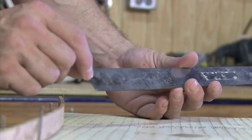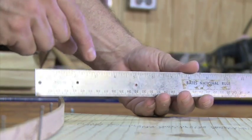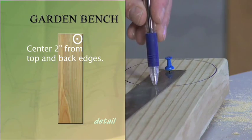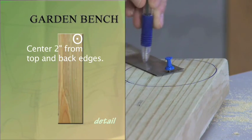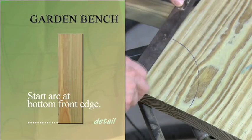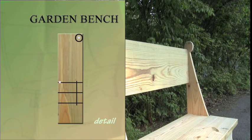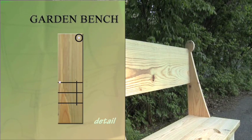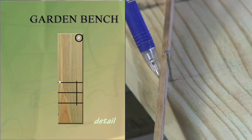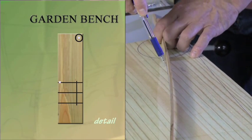Here's another simple trick — an old ruler. It had one hole already drilled in it so you could hang it up. What I did was drill two more holes, one at two inches and one at five. That allows us to create a nice arc pattern any time we put a pin in one hole and a marker in the other. At the bottom front edge of our piece, we need to draw an arc — for that, we'll use the hole at the five-inch mark on the ruler. The last curve we need is along the front edge. We need one more finish nail on the top line closest to the front. Place the bender board against the nail, hold it in place at the top, aligning it with the center mark of the circle. Apply pressure against the nail and draw a line along the outside edge.